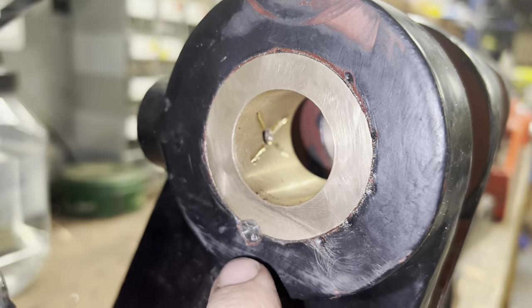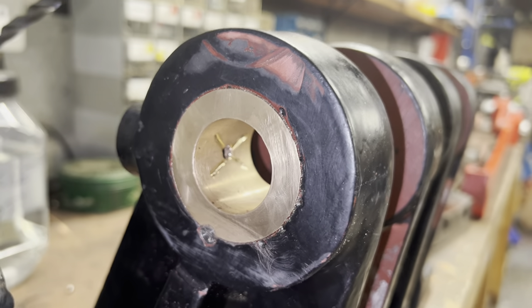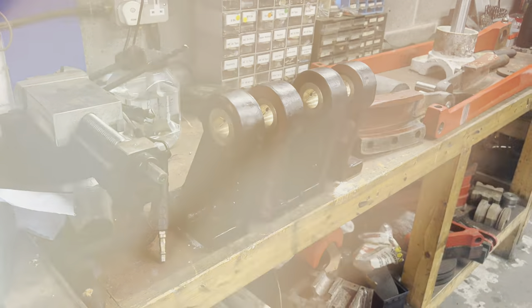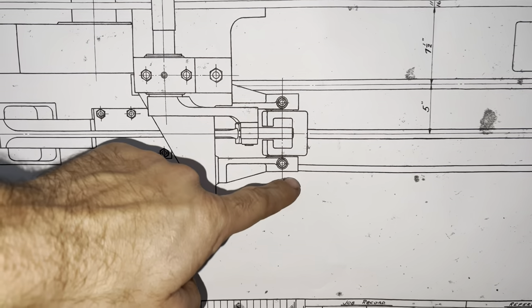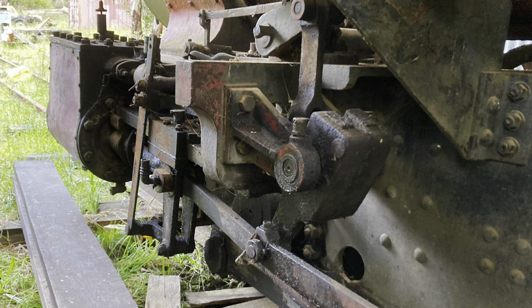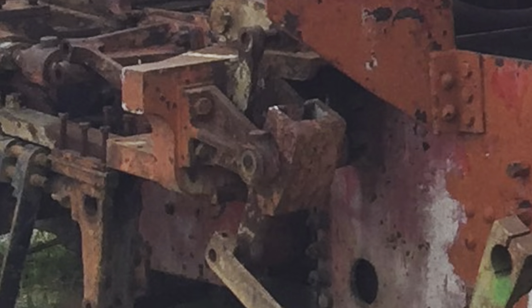It probably wasn't necessary, but we've put a little grub screw in there as a keyway to stop it from spinning. You can see we've ground an oil cross-pathway in there from the lubrication pot and hole at the top. Looking at the drawings from the top, you can see there's one either side with the pivot line across for the top of the expansion link. This is the sister engine, number two, preserved and looking all oily, so you can see how it goes.